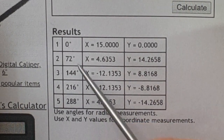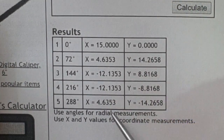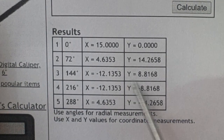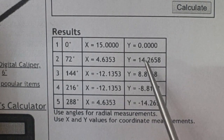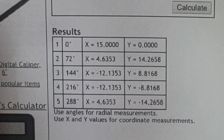Here are the results of that calculator. We've got five holes — one, two, three, four, five — and we've got the degrees of angle for those various holes. Then on here we've got the X and Y, which is obviously winding your table handles in X and Y to get to these various locations.